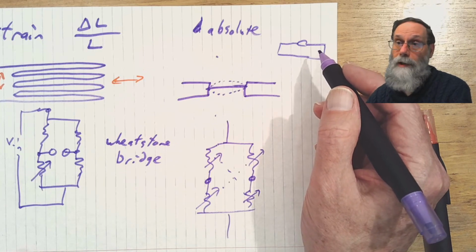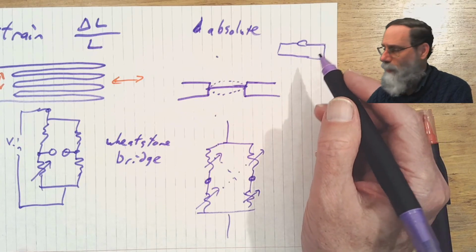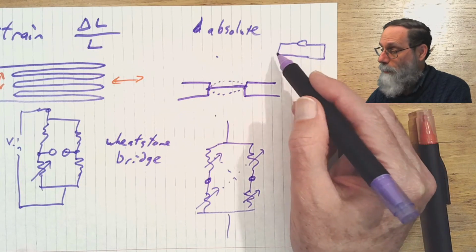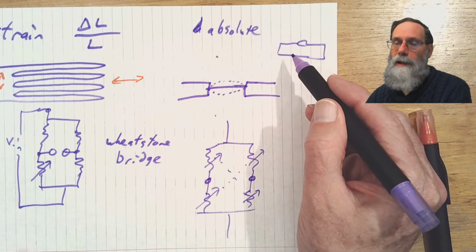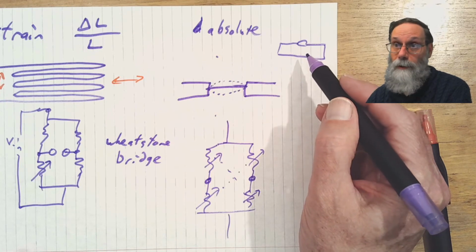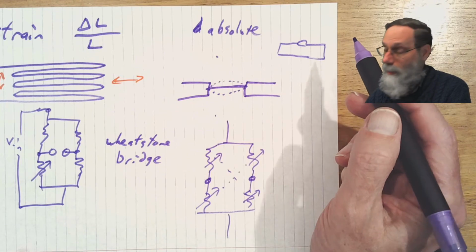It's a zero pressure, but that larger pressure difference may not be desirable for the amount of strain that it puts on the membrane here. So you might very well make a box here with a fixed pressure in it that's not zero, but closer to the average pressure you expect to see.